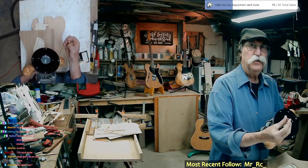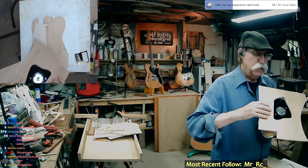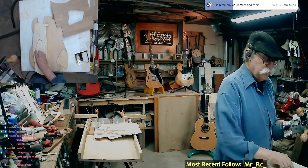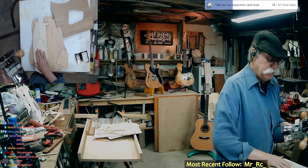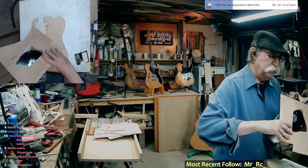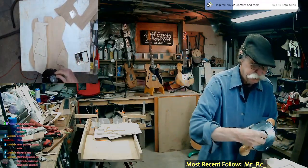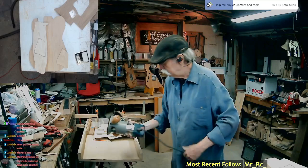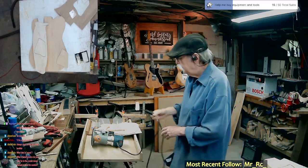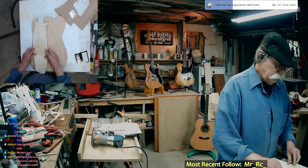This, and then another cap that goes over the outside. So you take your template and run it around the big one, which turns around and cuts this channel. Then you clear out the inside of the channel, you pull it off, go around it again, and this time it creates the plug, in this case, and then I turn around and put this in, and it fits.